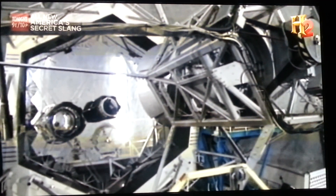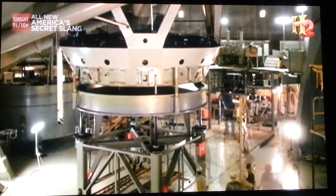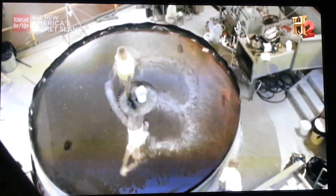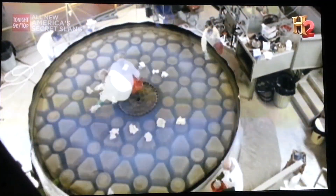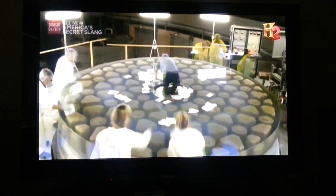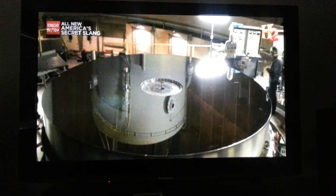It's a major event for observatories and a necessity about every two years. First, technicians must remove the mirror from the telescope's housing. Stripping off the old coating starts with soap and water. Chemical solvents then eat away the aluminum coating to reveal the underlying glass base. Next, paper towels are used to clean and dry the glass before a vacuum chamber lowers into place and deposits the shiny aluminum.